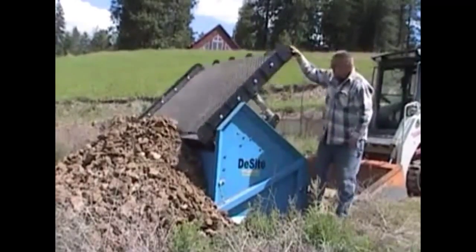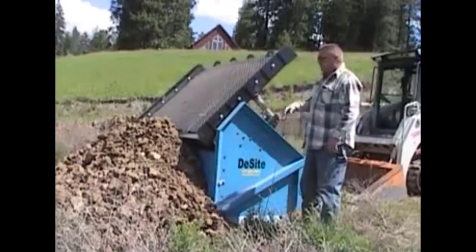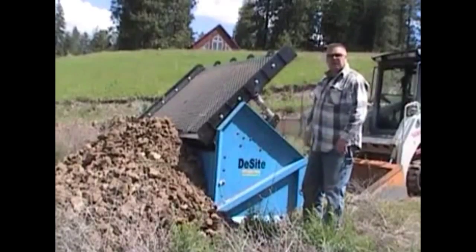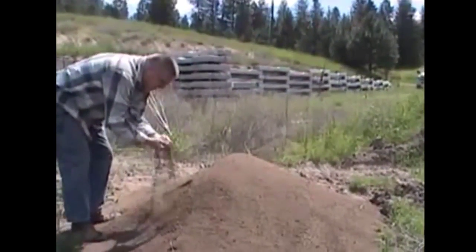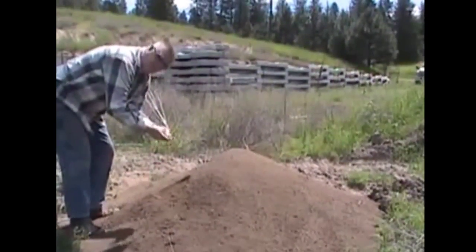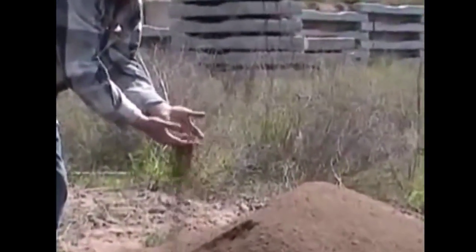As you can see, there's 10 to 12 inches of movement in this deck, allowing you to physically move it up and down. I'm running a three-quarter inch square pattern mesh, and this is kind of a sandy dirt loam material, but with a three-quarter inch square pattern screen, this is the product that we were separating out.